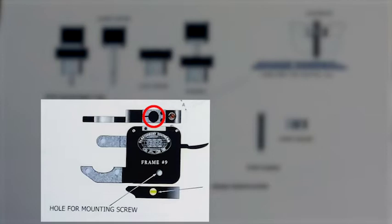It's got a screw in the side of it that you can put the indicator in and tighten in place. Then we also have a tension screw. This tension screw is in the very bottom of the frame here. There's a big spring in there that pushes against the lever arm. If you turn that clockwise, it'll tighten the tension, so it makes it a little harder to hold it up and down. It gives you a better grab onto your product thread.